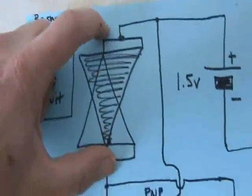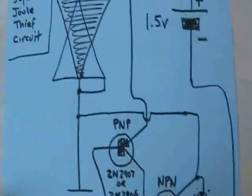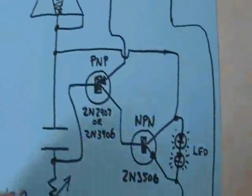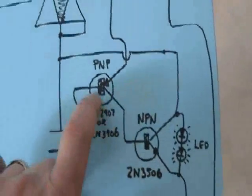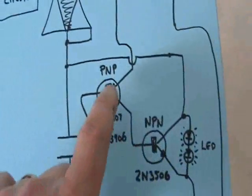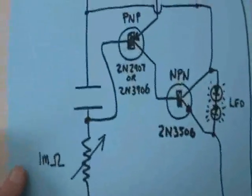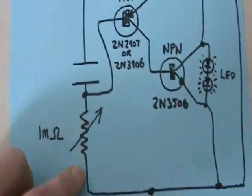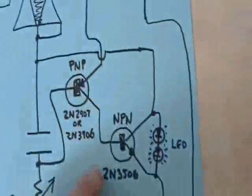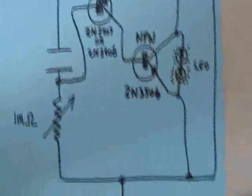What's interesting about it is you only need an inductor — you don't need a one-to-one transformer to run your LEDs. But what you do need is two transistors, a PNP and an NPN, so that those produce the 180-degree phase shift to support oscillation. You also need a capacitor, and I put a variable resistor here.